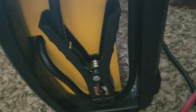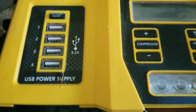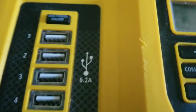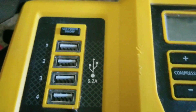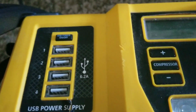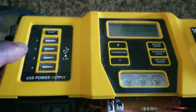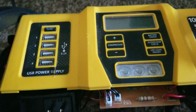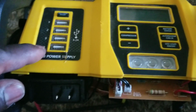Then I can use a 12 volt DC to USB charging port, which is going to be a faster, rapid charge. Because these guys here, if you go to the manual or the specification of this thing, I'll put it in the description below, it tells you it's 6.2 amps. So 6.2 amps divided by 1, 2, 3, 4 ports right here. I think you end up with a 2.1, or 1 point something. So if we do the math correctly, 6.2 divided by 4 is 1.5 amps. So 1.5 amps charging a phone is too slow. It's kind of older technology.